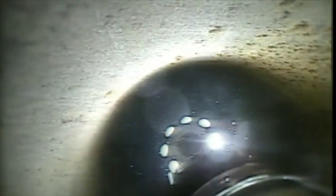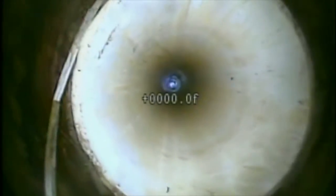The nano is now going down to catch up with the pan-tilt unit, transitioning from a PVC section into a steel six-inch casing. We're up at the top of the pan-tilt centralizer, going down past the pan-tilt unit to be able to see the camera head in operation. Going past the split in the liner at about five feet, and now we're at water level at nine feet.